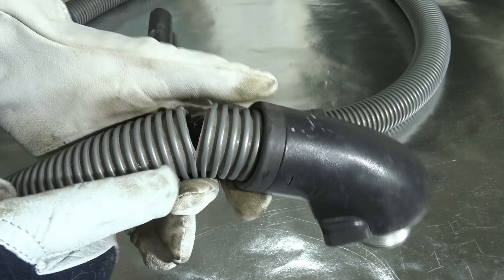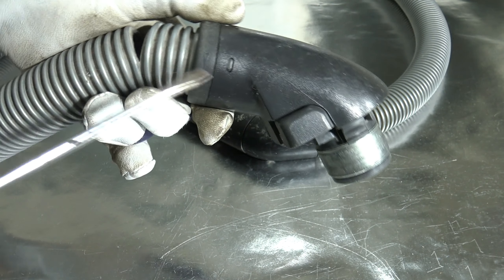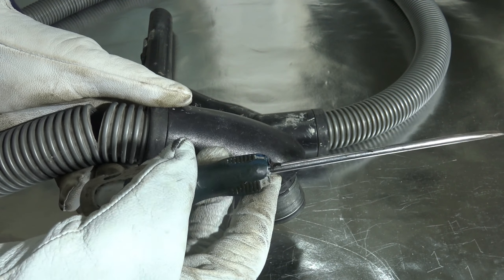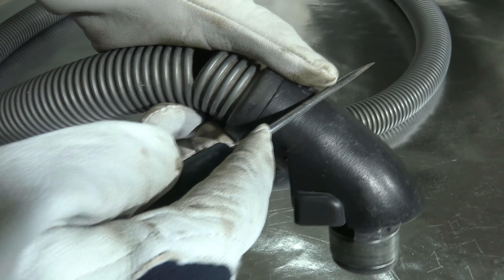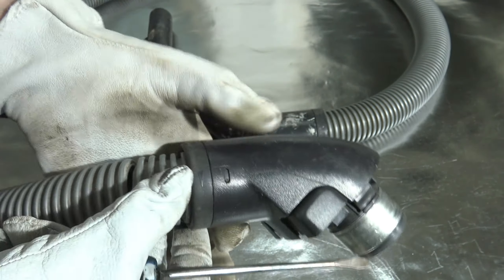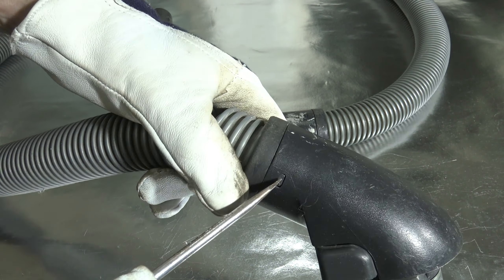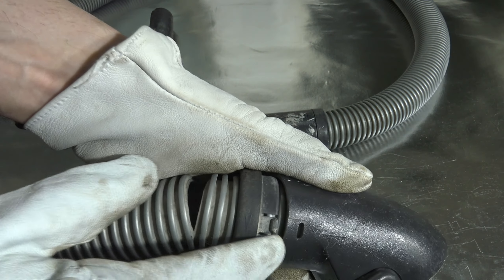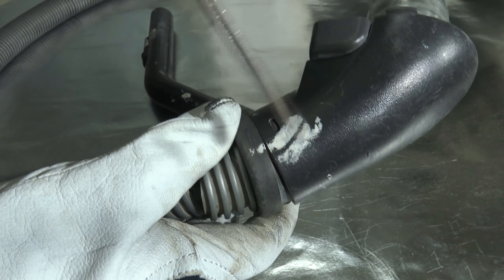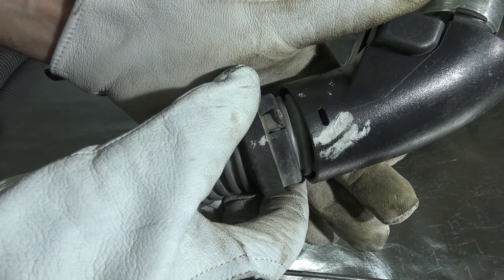This is very easy to take out. I look at the joint and there are small dents — one dent here and on the other side a similar one. Now I need a flathead screwdriver and I press it in this direction into this small area. At the same time I pull out the upper joint, installing my tool in here and gently pulling out this joint, and then that area is ready. I press this area down carefully and take this joint away.